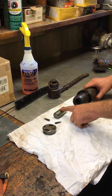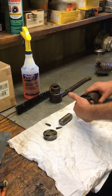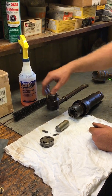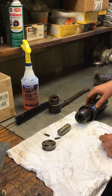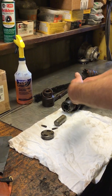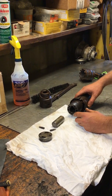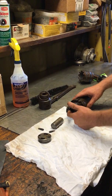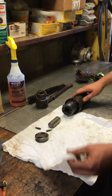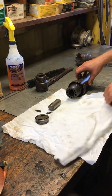You'll clean this up using sandpaper — real fine grit sandpaper — so you're not scarring up the piston or the barrel. A wire brush can be helpful as well. When it comes to cleaning out the barrel itself, if it's not too rusted you can get away with using a coned wire brush. Stick it in there, twist it around, spray some air tool oil or PB Blaster in there. After you get that scrubbed out, take a rag, stick the corner on the end of a dowel and just push it through to work out any extra debris from the barrel.